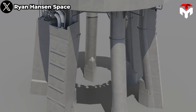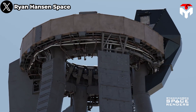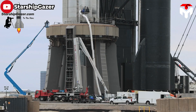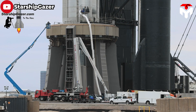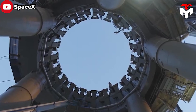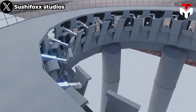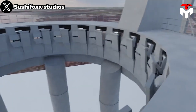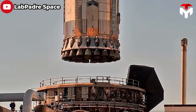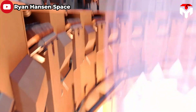The hexagonal symmetry all the way down to the support's foundation piles shows that SpaceX's Starship launcher design can withstand the minimum required for a sturdy launcher. The launch table is the most notable component. It has a diameter much larger than the 9-meter Super Heavy booster and a height of about 5 meters. It has 20 separate hold-down clamps that attach to the bottom of the booster for static fires and launches. These clamps are made of stainless steel, designed to be very flexible, and activated by a remote control system.